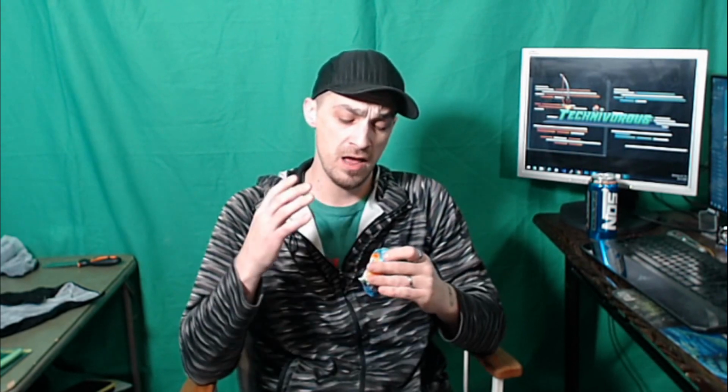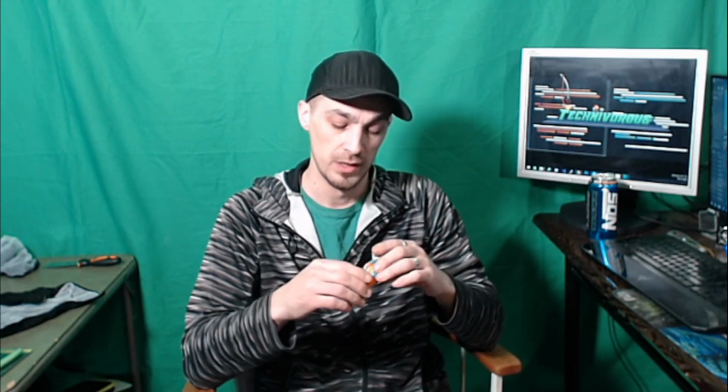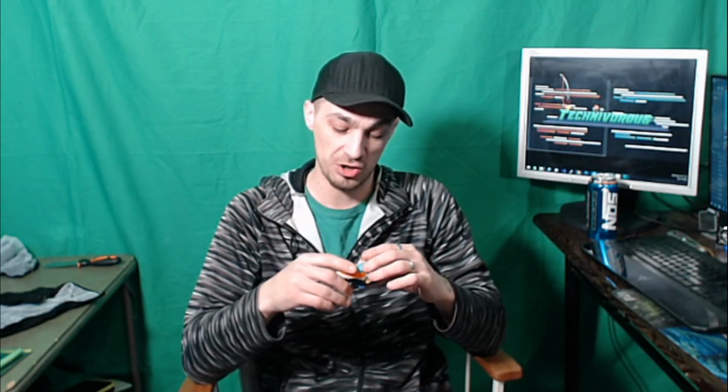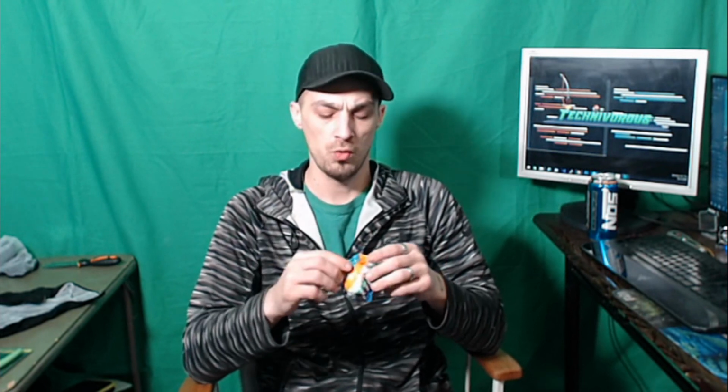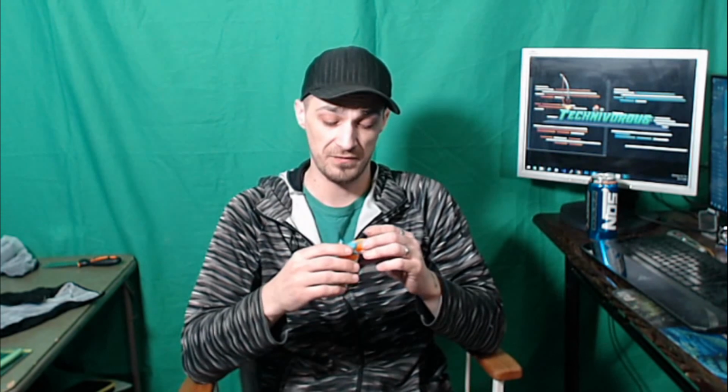Now, I have a 1mm nozzle around here somewhere, and I've been thinking about throwing it on and doing some vase mode prints on the ET4 as well. So today we're going to do just that, and we are going to continue using the scrap. So we're going to start off a multicolored, really thick vase.